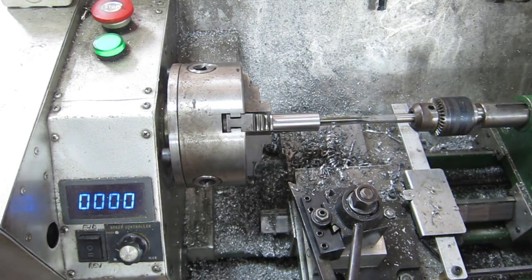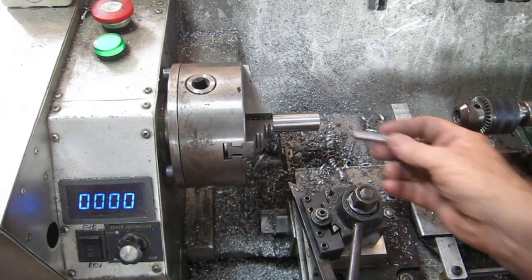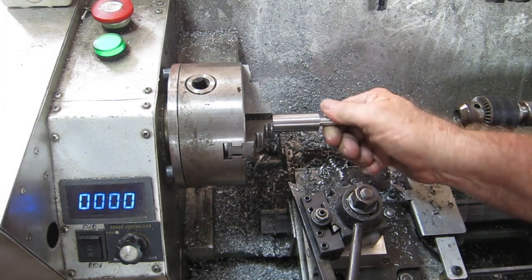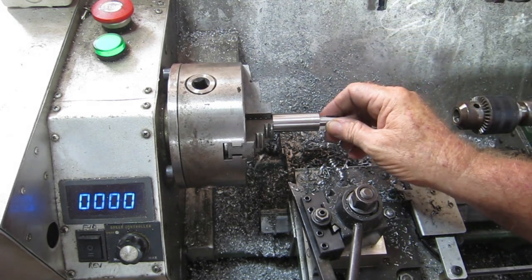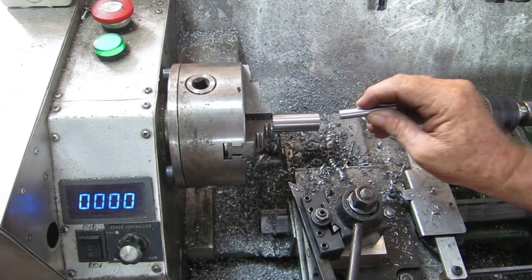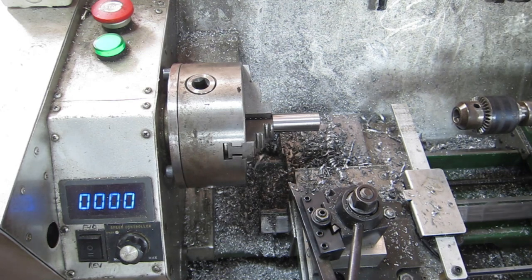That's the reaming done. It's a little bit loose again. I think the tailstock's out a bit on this lathe — it cut perfectly in the mill when I used it there, cut beautiful 10mm holes. But the part that needs to be 10mm is way down in there, so it's only that section down deep that needs to be spot on. Now I'm going to take a 14mm drill up there and then I'll have to bore it out just a little bit.